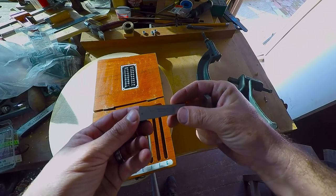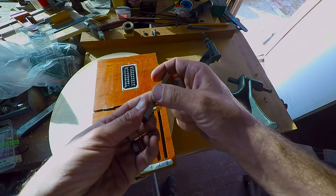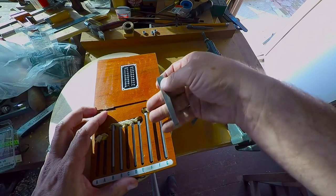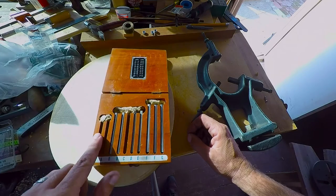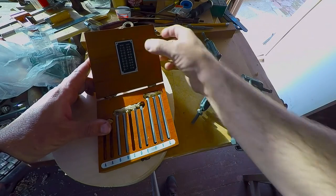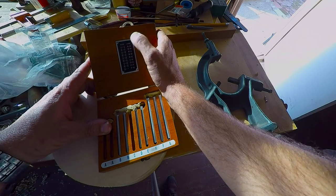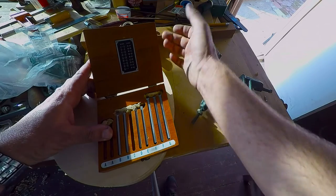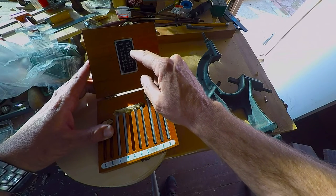They're a Brown and Sharp number 672, and they're really nicely ground. Some of them may need a little polishing on the edge — they feel like they might have some small burrs, which would throw the accuracy off. I might see if somebody with a surface grinder could remake the missing ones. Two A-bars are missing, which cover one-quarter to five-sixteenths, and the C-bar is also missing — it's only used on two different sizes.